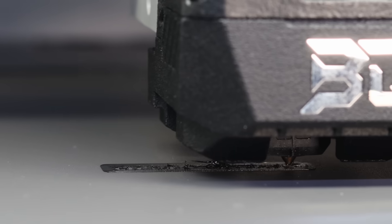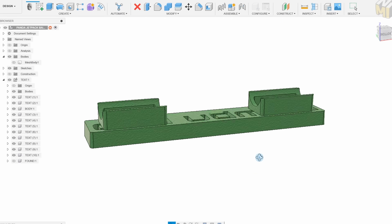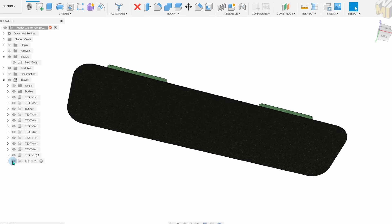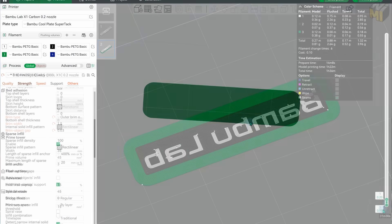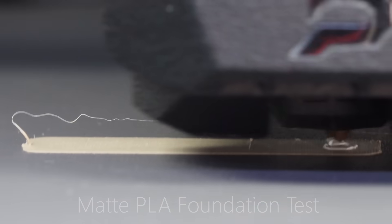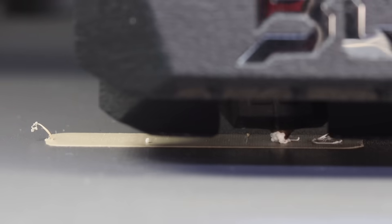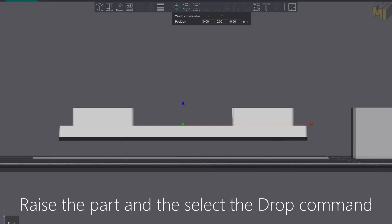Here is the print with all the pro settings applied and the first layer slowed down quite a bit — it's getting some bonding but not enough. There is one more thing we need to do that doesn't work without it: add an object below our print. What I was able to do is draw what looks like a brim but is really a solid printed raft. At this small scale, this is the best way to get the filament to bond instantly and achieve the precision we need. I'll add a green sacrificial PETG layer, and the final print will have white text and a black surround. PETG likes to bond with PETG — any other material I tried did not produce good enough results. If you didn't design the part yourself, you can right-click and load a primitive shape, then raise your part to make it work.